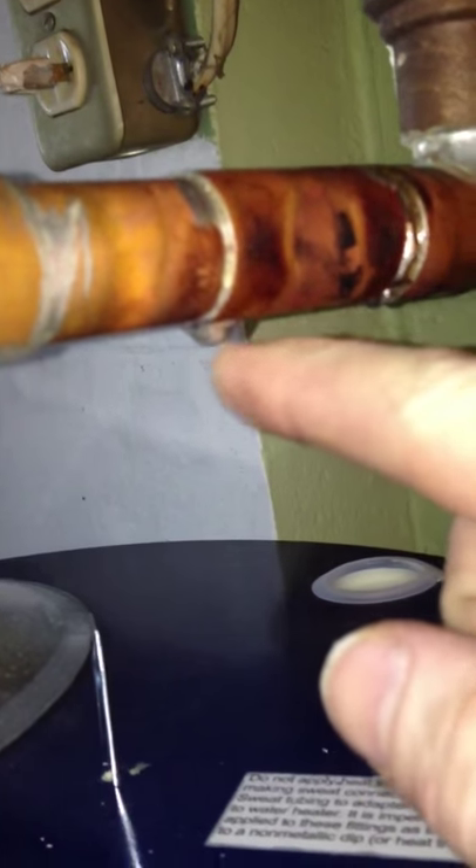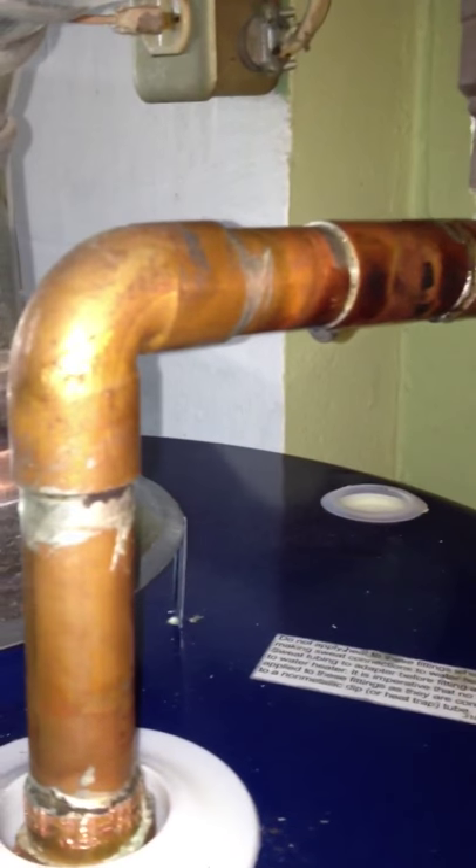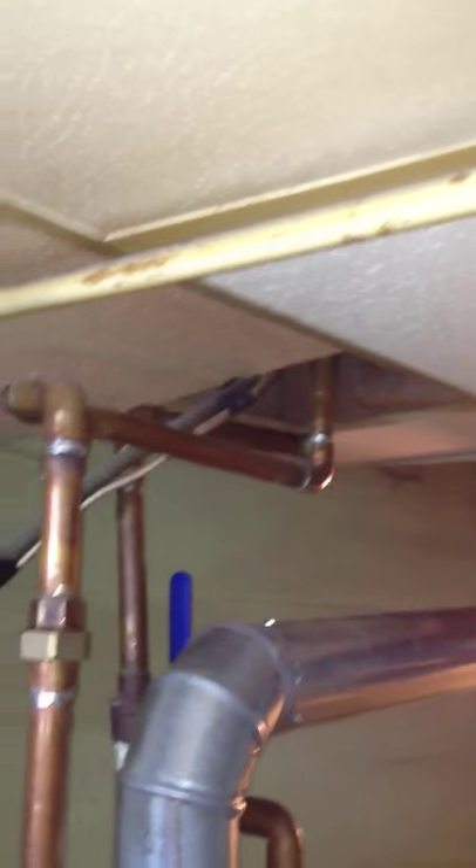I got a little solder bubble down here but I'm not worried about it. So I cut it right here. I turned the water off — this is the incoming water. I turned it off. I'm just going to cut it right here, drain it out, no worries. Well, when I cut it right here I couldn't quite get my pipe cutter in here. I kept kind of hitting this, so I had a little bitty tiny piece left — just enough to where when I pulled on it I pulled it this way. This whole entire pipe right here broke and fell out. And since this is the cold incoming, you can imagine what happened — all of the water that was coming from the street started running out all over my basement.